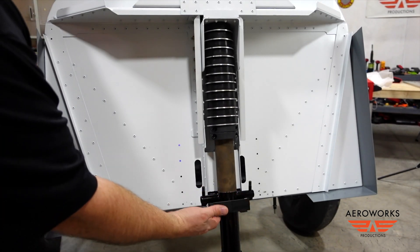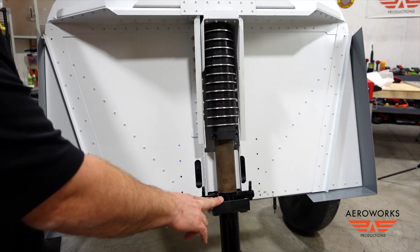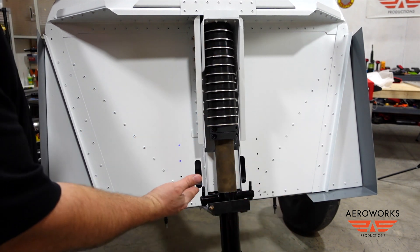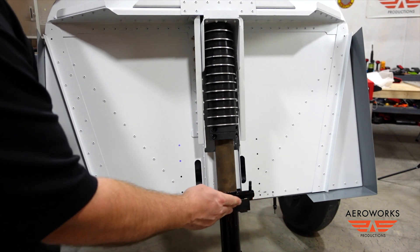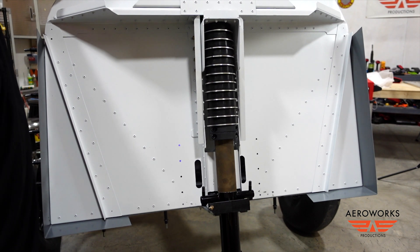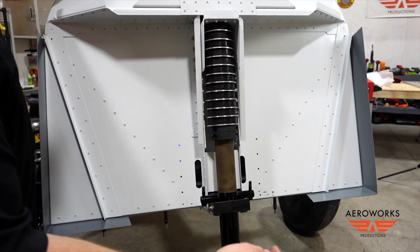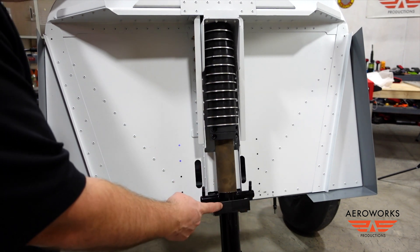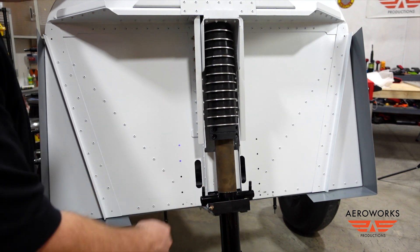This lower support bearing and lower support here — I don't care what anybody tells you, I'm going to use an industry term here — but these things are a mofo to put on. Between having the pucks at the right tension, trying to slip it in, wedge it in the back, trying to get bolt holes lined up, getting your threads lined up — this required a good size mallet to get everything to fit correctly. It's a combination of slipping it in from the top, sliding it over, putting these around. You're doing five things at once. If you have any difficulties, shoot me an email or leave a comment and I'll give you some tips.